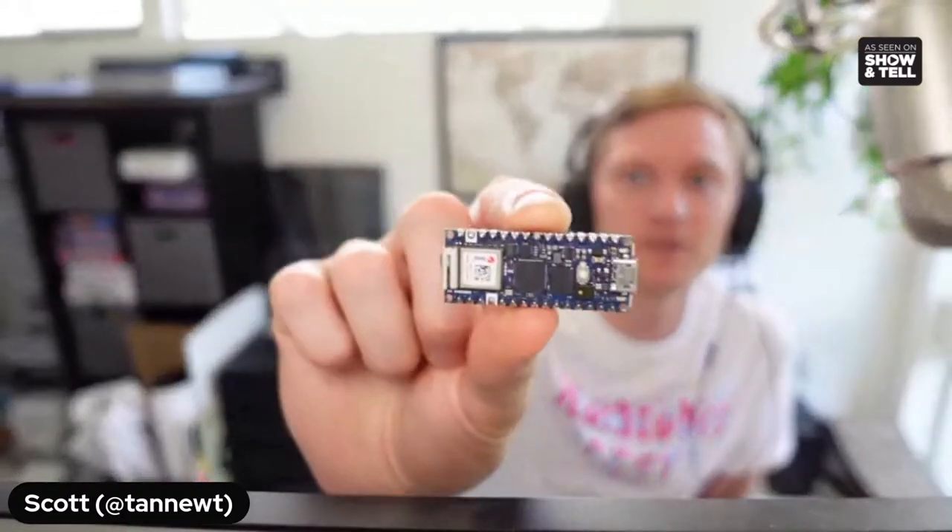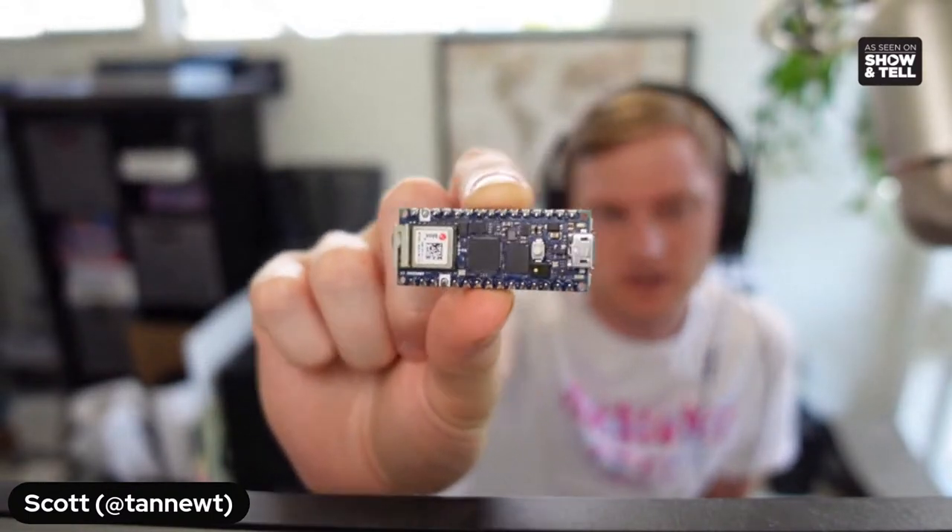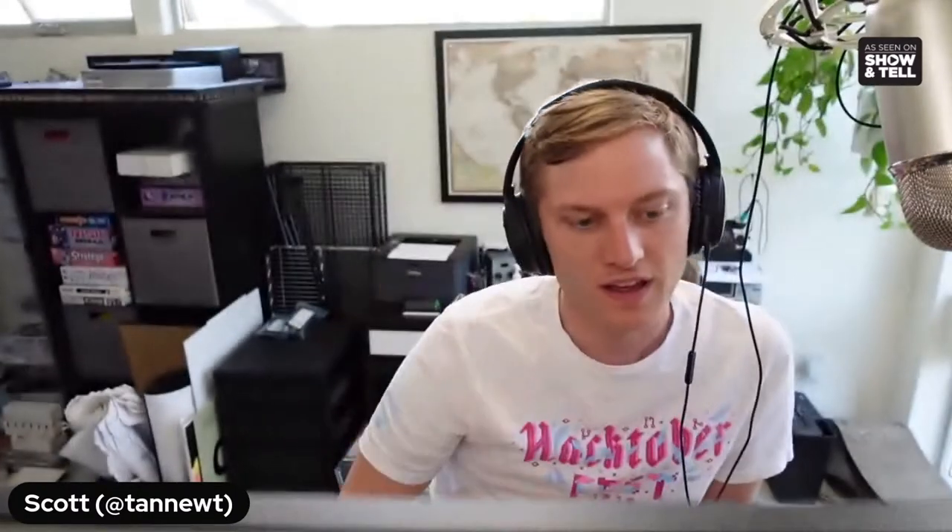Next up, Scott — what have you got going on? I wanted to do a plug for the release that Dan just did: CircuitPython 7.0 alpha 5. I just got one of these — the Arduino Nano RP2040 Connect. Shout out to Blitz City DIY who made the CircuitPython board definition. Unfortunately the flash chip doesn't tell us what size it is, so it was falling back to the default size. If you have one and it has a one megabyte file system, in alpha 5 I just fixed it — back up all your files and then run storage.erase_filesystem() to get the 15 megabyte file system.